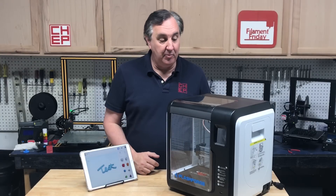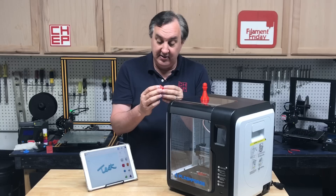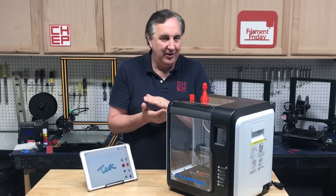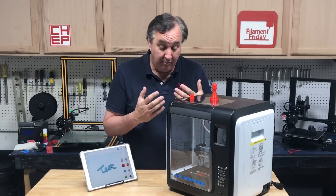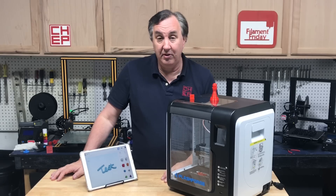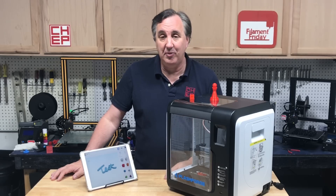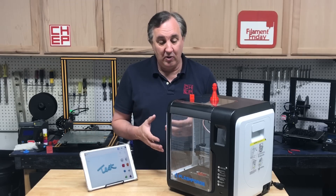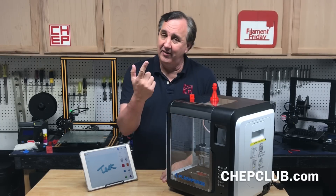I even sent other prints — a Chep Cube and a Chep Pond — and they printed pretty good. The print quality I'm getting out of this thing is decent. A little bit of elephant's foot on the prints because the auto bed leveling is just not perfect and you can't adjust it perfectly. But the detail is actually really good for the price of the machine — right on par with the Ender 3 and some of the other printers I have. I'm going to dive deeper into what this thing is capable of. Especially I want to try some ABS, since being enclosed is a real advantage. What do you guys think of the Polar Cloud and designing with Tinkercad? I'd love to hear your thoughts.